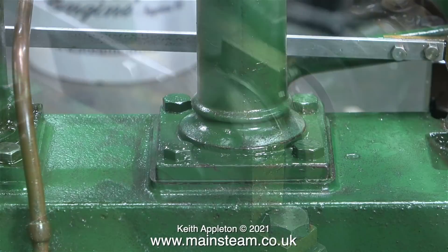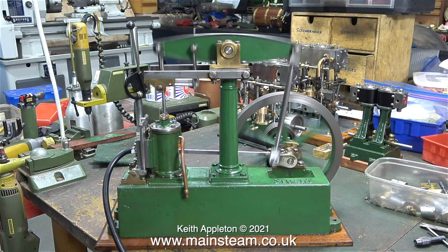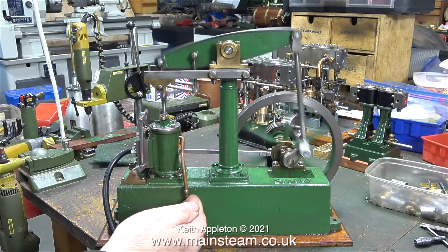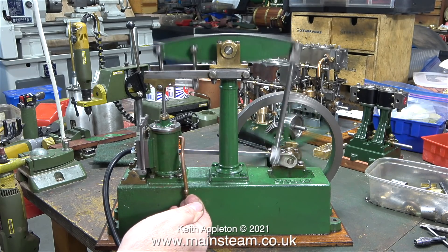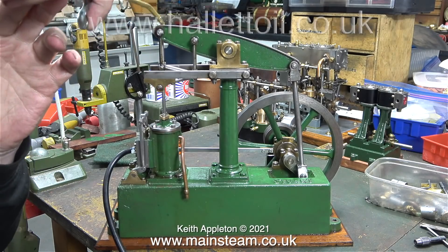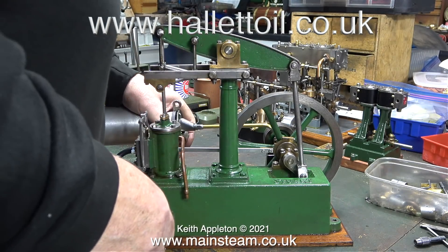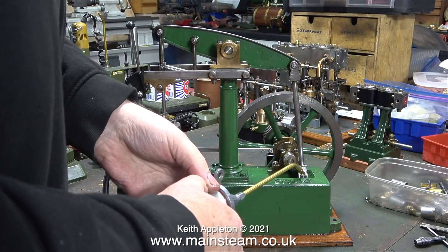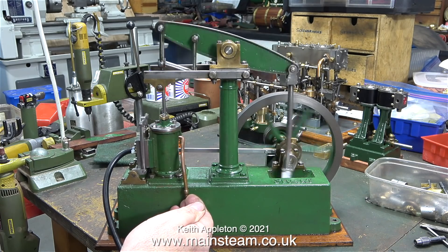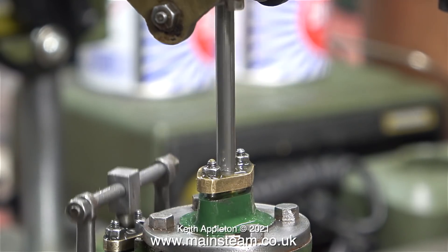Here was another area that required some paint — two of the column bolts were painted and the other two had lost the paint. I don't want to make it look like a new engine; there's a charm in the way it looks. The valve timing is a lot better and it's running quite sweetly now. After running the engine fast, all the oil flies off the bearings, so it's a good idea to stop and lubricate it. I'm using general purpose lubricating oil from hallatoil.co.uk — they supply all the oil you'll ever need for running full size or miniature steam engines. The air blast from the exhaust is very even at both ends of the stroke, and I'll be posting it back to the owner next week.